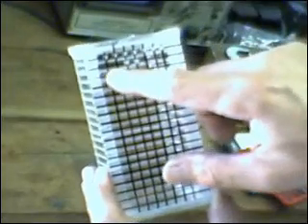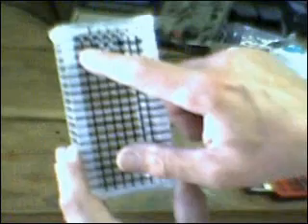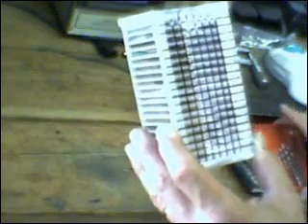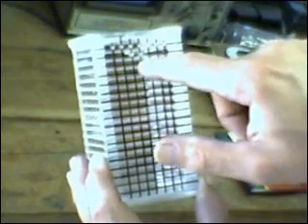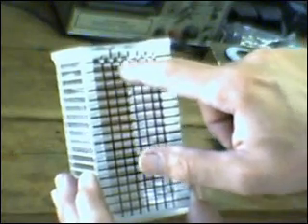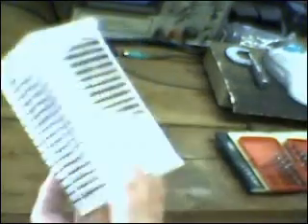I've begun drilling some pilot holes here — 3/32nd inch holes as my pilot holes — so that when I throw the 1/8th inch bit, or I might even go slightly larger, maybe 9/64ths, it'll keep it centered as it drives through and it won't have a tendency to walk around as a drill bit will have. My tolerances are pretty close; I need to get these fairly well centered in between the plates, so that's how I've gone about that.